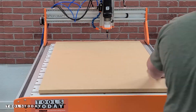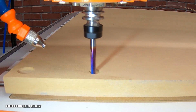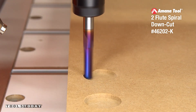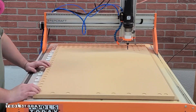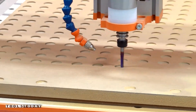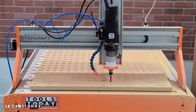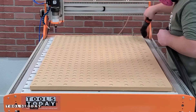Starting on a new project here to make a work holding waste board for the Stepcraft M1000. I got it all stuck down to my waste board that I was using as a sacrificial waste board and using the 46202-K quarter inch spectra coated down cut bit, we're going to go through here and cut in the pocket for all of the T-nuts. We're going to use T-nuts to hold everything down so we need a pocket for the head of those. There are over 450 holes here and the Amanatool line with micro grain carbide did a really nice job leaving perfectly clean cuts and the bit is still looking brand new.